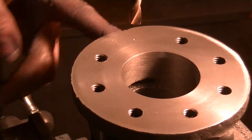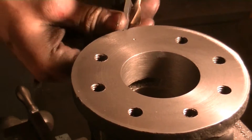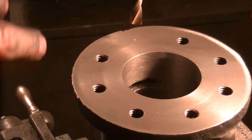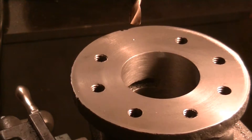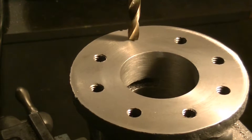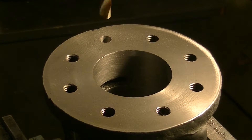We're on the last hole here. This last hole is actually above the steam port — you can see it on this side. We have about 800 thousandths of space until we hit that. So we're going to go about seven-sixteenths down and then use a bottoming tap to get to the hole.